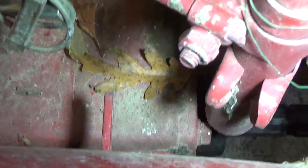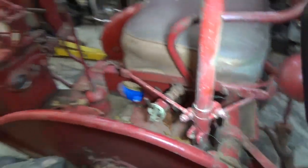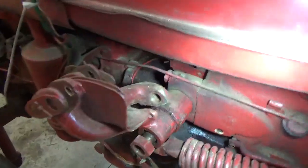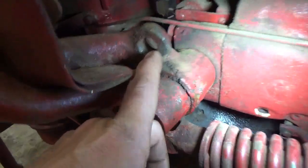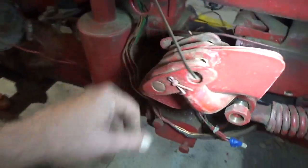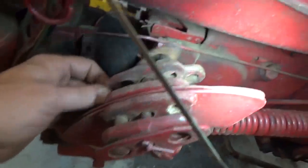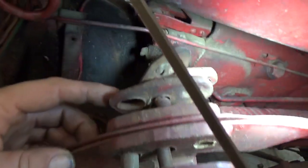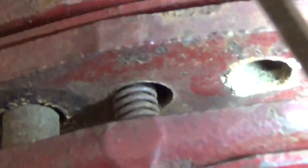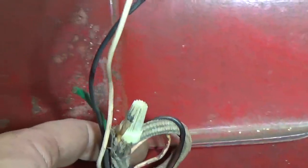We'll have to do something about the seat bracket, but that's not going to be anything major — it's an actual bracket made for the 142, not a homemade job; it's a pretty nice, well-thought-out piece. One thing you're going to see a lot of: the lift components — the joints get totally worn out. They are not greasable, unless you take them apart and grease them before assembly, but most people don't bother. You can see right there that one's almost a full oval.